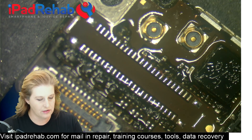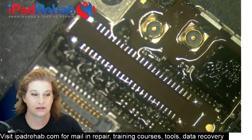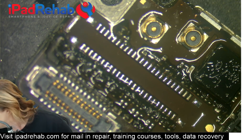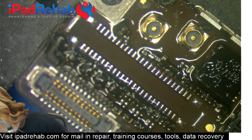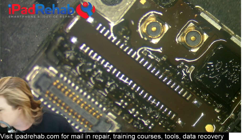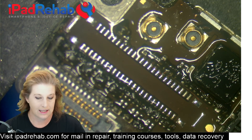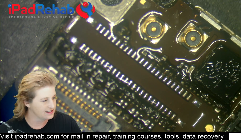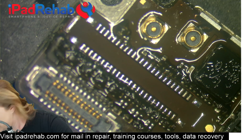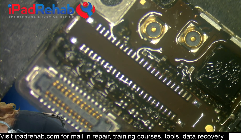Now it's your choice whether or not you want to braid these pads or not. There's nothing wrong with braiding as long as you have a good reason. You could make the argument: I'd like to braid these pads because I would really like for the new connector to go on fully leaded solder pads, not a mix of the lead-free and leaded solder that we have right now. So let me see if I can dig up some braid.